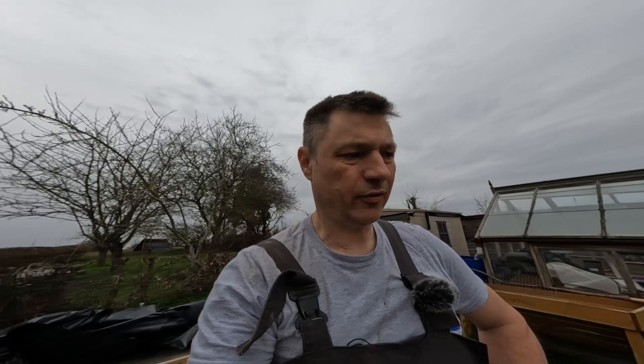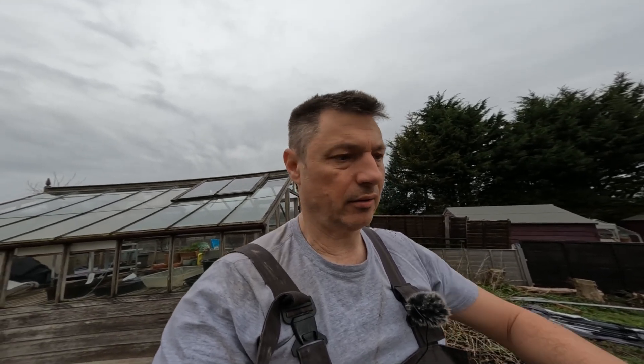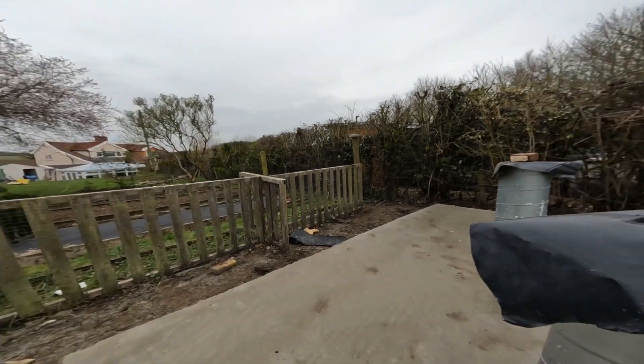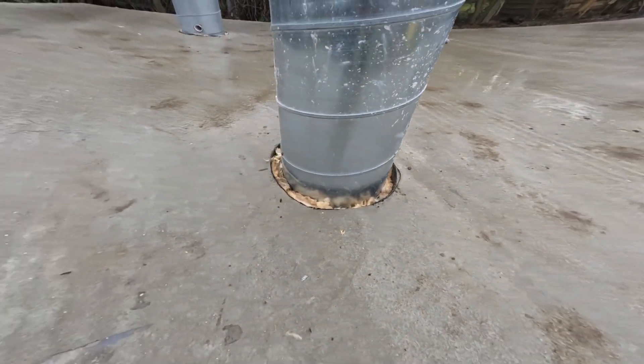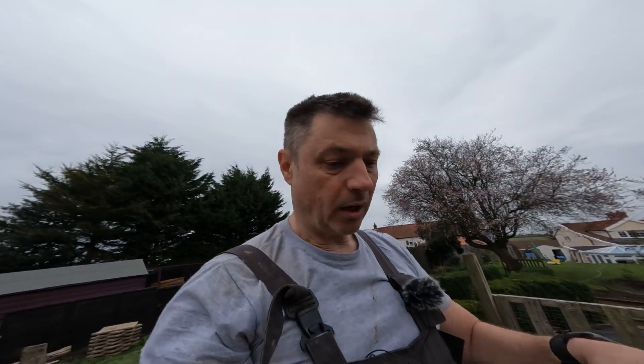Well, that's all the shuttering off. I've got a little bit of work to do on the sides. I just want to backfill some earth, and then down there we've got some exposed rubble which is underneath the concrete. I'm going to make up a cement and sharp sand mortar mix and just skim that over so that everything's tied in and we can't lose any rubble once we've started moving about on top. I've put a bit of mud on the top again even though I just washed it off, but there's loads of mud everywhere. It all works with the isolation on the piers - there's a lovely gap all the way around going down to the pad from the big slab. The big slab is not in contact with the piers or the pier foundations at all.